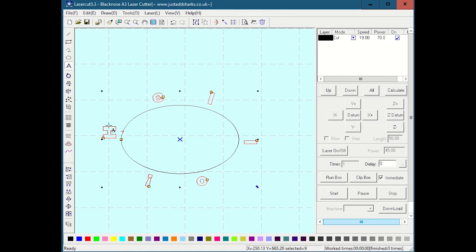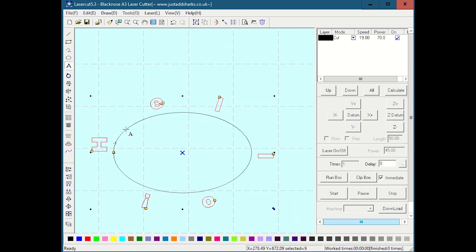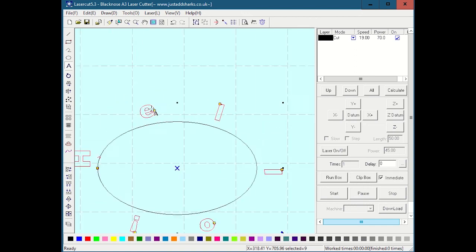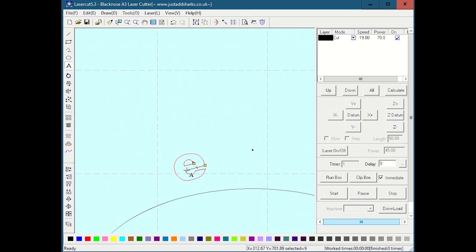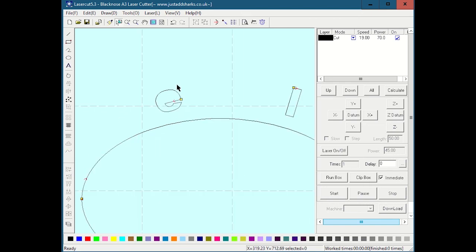There's one other thing. Like we talked about before, this is the type of text you would engrave. In engraving, the head moves back and forth, turning on when it's inside this geometry and off when it's outside, so it becomes dark. So these types of text elements are what you would use to engrave. Because if I were to cut along the cut path, it would actually cut a nice letter E out of the material. But since this isn't a stencil font, this middle piece would fall away, and I'd basically wind up with a cut piece that would look like that, which generally is not what you want.